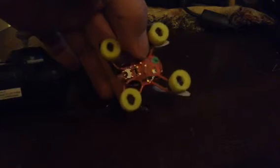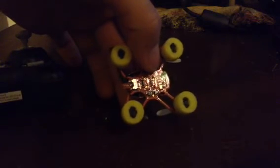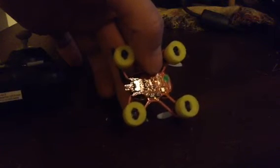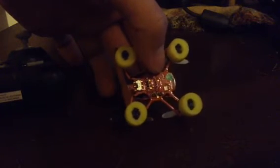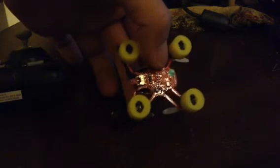One of the other things that can be done to it: the bottom of this circuit board is wide open, so if anything metal lands on the contacts, it can cause damage to this board. You can see the shininess. That is board protection. It's been sprayed over. I do have more of that spray to spray on it, but I don't think I'm going to do that. If I was going to coat it with anything, it'd probably be Plasti Dip spray. You spray over it, that way it waterproofs the board.